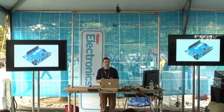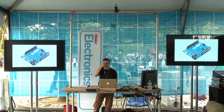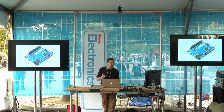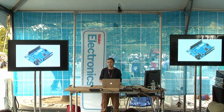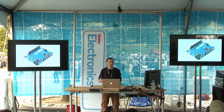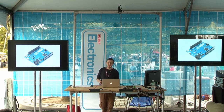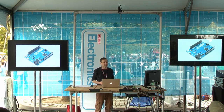At the heart of most projects there's an Arduino-compatible device. It allows rapid, cheap prototyping for embedded systems, and it turns what used to be fairly tough projects into simple software. As we all saw from the Valley, simple software scales really easily. The Arduino is an 8-bit microcontroller based around an Atmel ATmega. Like all development boards, it breaks out digital pins, analog pins, and other pins from the controller. Its footprint is a bit idiosyncratic, so you can't just stick it directly into a breadboard, but weirdly enough, this footprint has become popular enough that it's becoming a de facto industry standard.